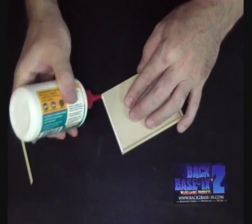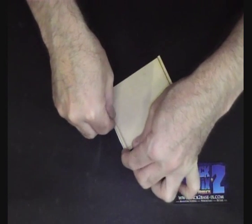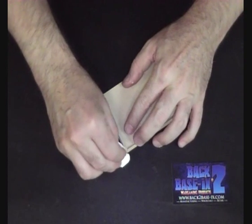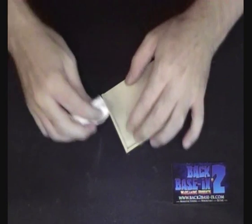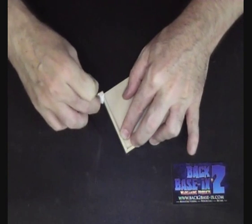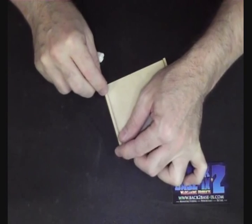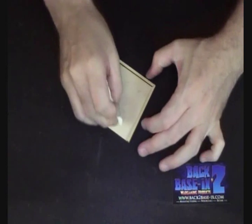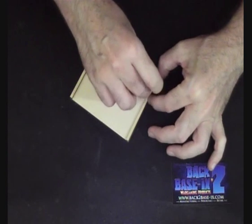Run the glue down that edge — same as the other side. Make sure the miter pulls up nicely in the corner, apply downward pressure, and make sure you're flush on that front edge. If any of the sides move, it means your glue is still drying and you've still got some working time — just go back and put them in the right position. There's no rush, take your time. Make sure it's flush on the outside, get it as neat as possible, and one more time clean up any glue on the inside of that lip.